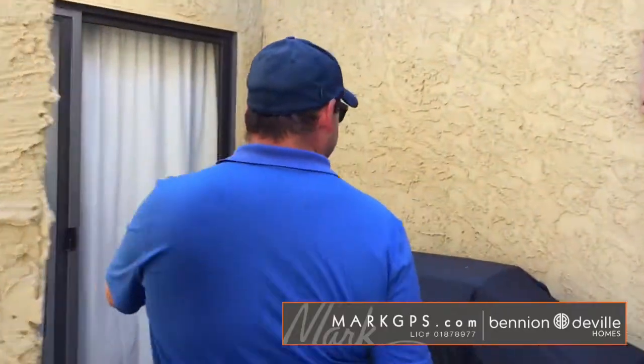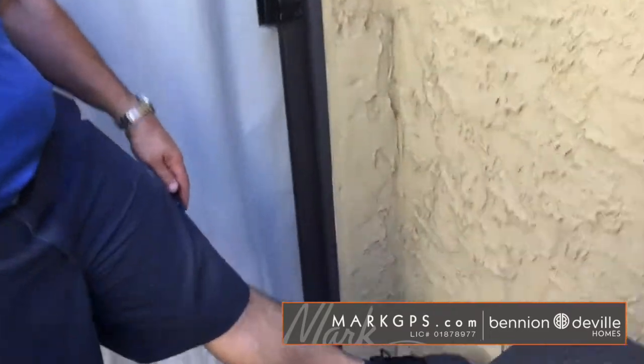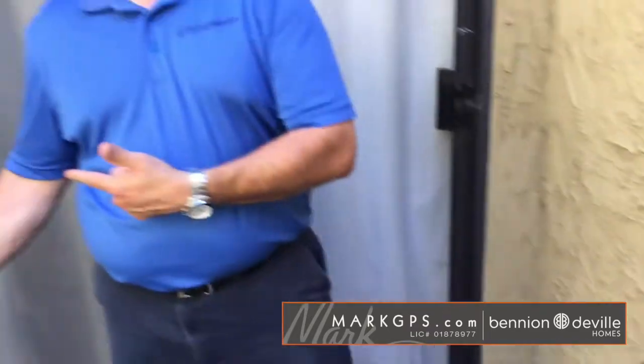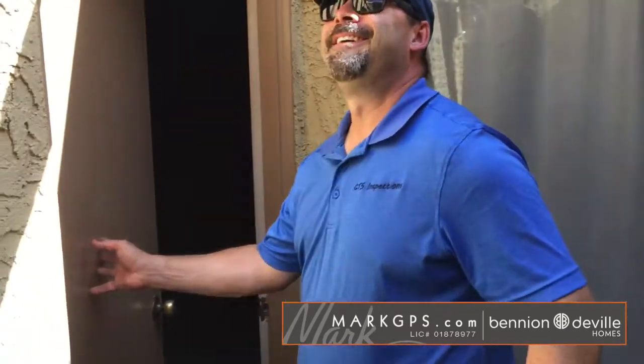Moving on the east side of the house, this patio right here, we have an outlet that is not GFCI protected. So you'll need an outlet that has the buttons that trip and reset. For safety, I mean that's been there probably since the beginning of time, but it's always been code. Just to put it in perspective.